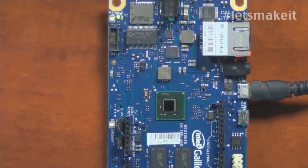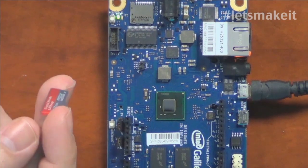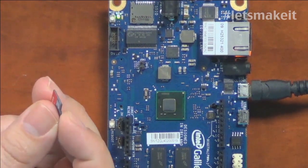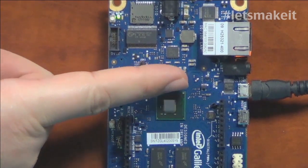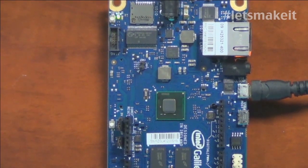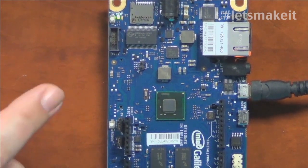There is a way around this — it requires a micro SD card in the slot, and it will then remember the sketch. You load the bootloader onto the SD card, then load the sketch. When it gets back out of boot, you'll see there's a USB LED — so it's still not ready yet. You can see how long it's taking just to boot the device itself.